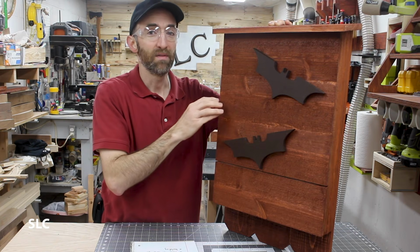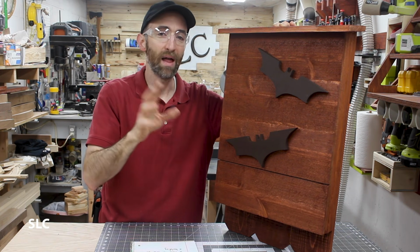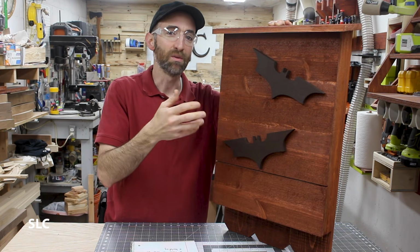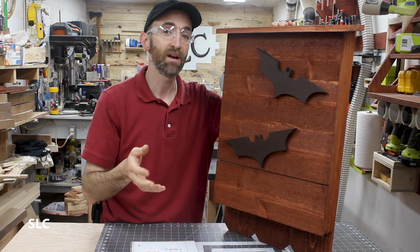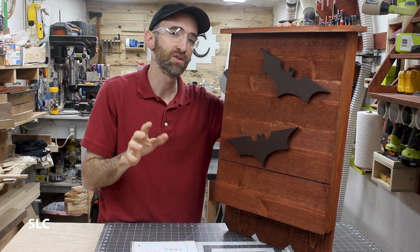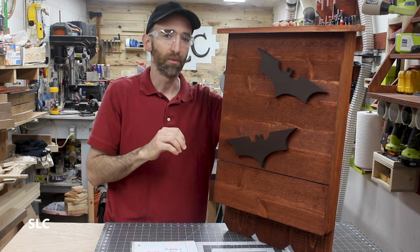It's also recommended that you put these on some type of pole, an independent pole out in your yard away from anything else, just to kind of keep them safe. In many cases you can use a metal pole or a wooden pole. In my case, I have an old telephone pole that's out in my yard and I'm thinking about putting it on there. There's also a place possibly on the back of my house that I could do that, but I've got to double check the 6 to 8 hours of sunlight time just to make sure that'll be appropriate.